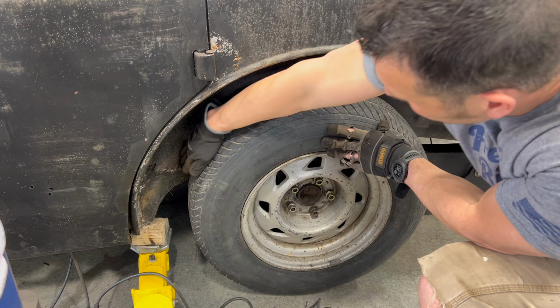we'll kind of hop into the inside of the Master here. What we'll see is that, you can see that's probably 3 inches that I've got between the inner fender well and the S10 frame. So I'm gonna cut this out and we're gonna move that in a little bit so we've got more offset. Well, not offset, but we've got more room for the tire to fit in here because we're touching. When that happens, the whole body is gonna go down.